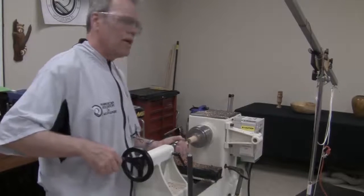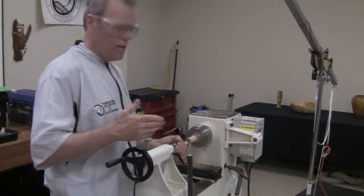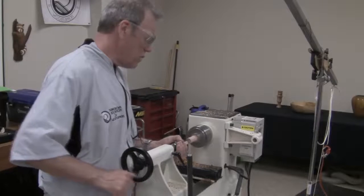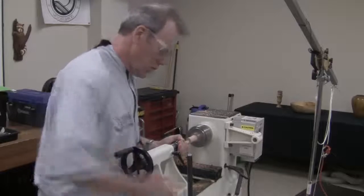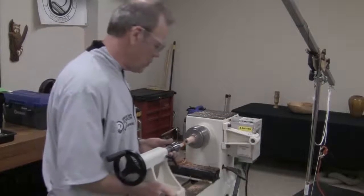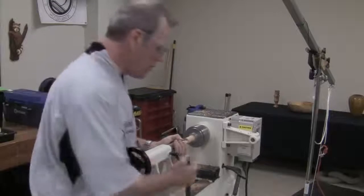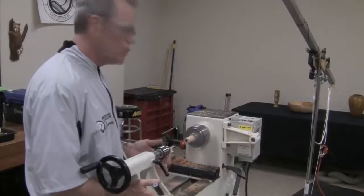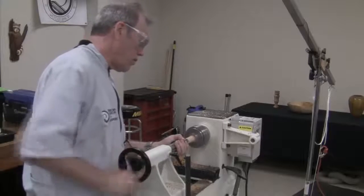I've heard complaints from people that do a lot of heavy drilling on a Powermatic, on a lot of hollow forms, that you can get some wear on your quill, and it'll eventually need replacement. And maybe that's what you've got. Oh yeah, Fred Warshawski had his replaced. Now I understand the newer, big lathes have a different design. They've got a different thread that's a lot more rugged on that big 4224 or whatever. That's less likely to have that problem. And in normal use, people are not going to have a problem.